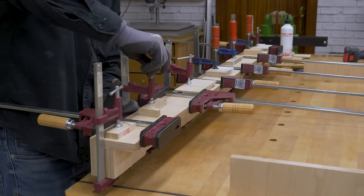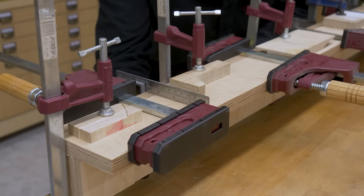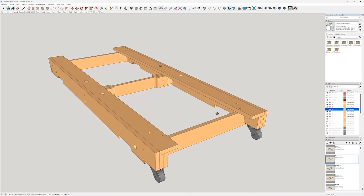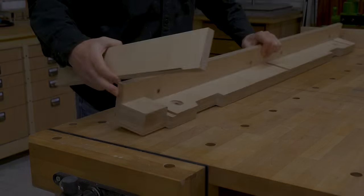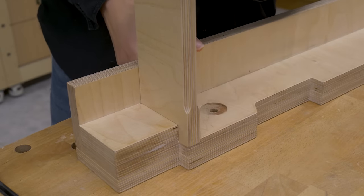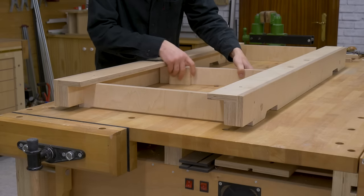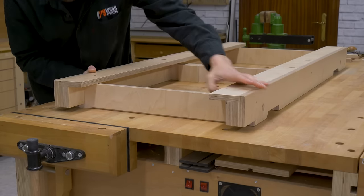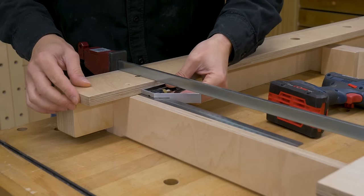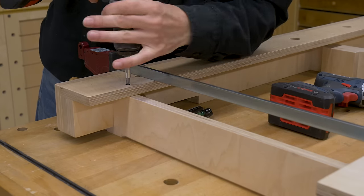It's important to ensure they're square. I've sanded down all the parts and applied a couple of coats of water-based varnish on all of them. Now I can finish joining together the pieces that make up the frame of this folding base. I'll use a clamp to position the parts and first I'll place the upper screws. I'll use the previously drilled holes as a guide to finish drilling the other parts.